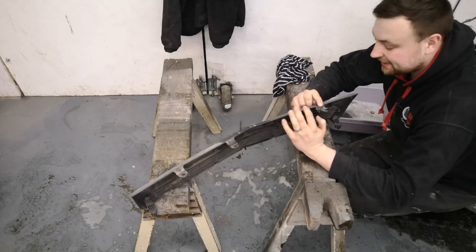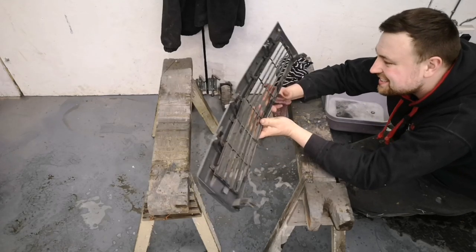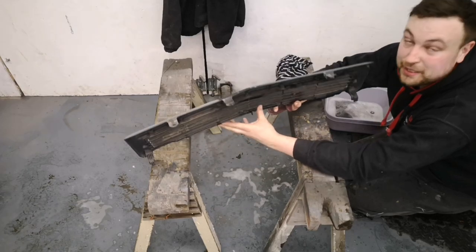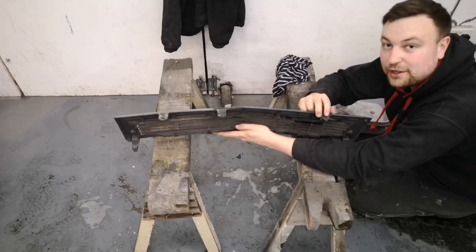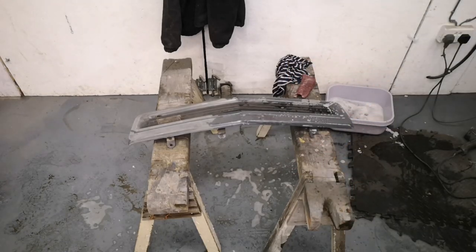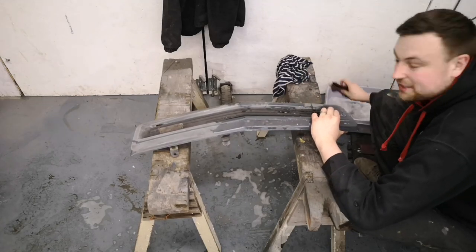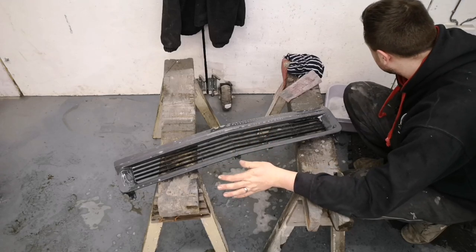The broken bracket — I'm thinking I might try to cut another bit of plastic and plastic weld it on. I'm not sure what kind of plastic this is — does anybody know? Comment below please. ABS plastic. So if I get another little bit of ABS plastic I might be able to cut a piece the right size and plastic weld it on. I could also two-pack bond a washer on top — it wouldn't look quite as nice, but it would do the job. I need to do something really because it's on its last legs. There's a particularly bad bit here, so I'm just going to use some Abranet cloth to polish that out. That's got rid of it nicely. I'm done with the red, I'm now going to move on to the grey Scotchbrite.